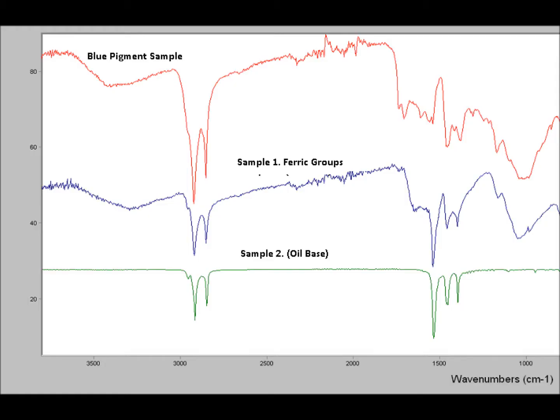So I have the results back from the lab. First, let's look at the FTIR results. This is the spectrum we get from the FTIR machine. The red line at the top of the spectrum is from the paint sample. The two lines underneath are samples from the database — for iron groups and oil-based groups in particular. We determine the exact type of paint by looking through our databases to find spectral lines that match up with the sample's line. See how the curves fit nicely? This shows that those components are in the paint sample. These particular characteristics lead me to believe this is a metallic-based paint.